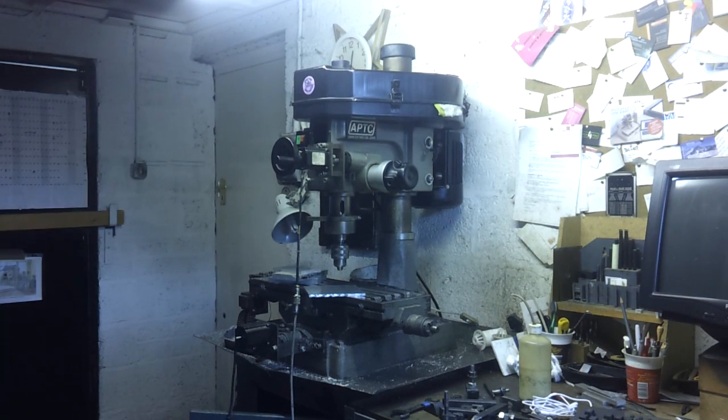As for the milling machine, this is an old Axminster system which I picked up about ten years ago — I think I paid about £500 for it. They still sell them new for about a thousand pounds, but you will find them second hand. This one has done probably about ten to fifteen thousand hours. It will run all day, eight to ten hours a day, and will hit about ten micron accuracy after you've dialled everything in. This isn't actually a CNC machine — it's a manual machine that I've retrofitted a CNC kit onto. This kind of technology has been around for well over a decade. If you can use a 3D printer, you can use something like this. A lot of schools, colleges, and hackerspaces have got this kind of facility already, so getting access to a CNC milling machine is not all that difficult.